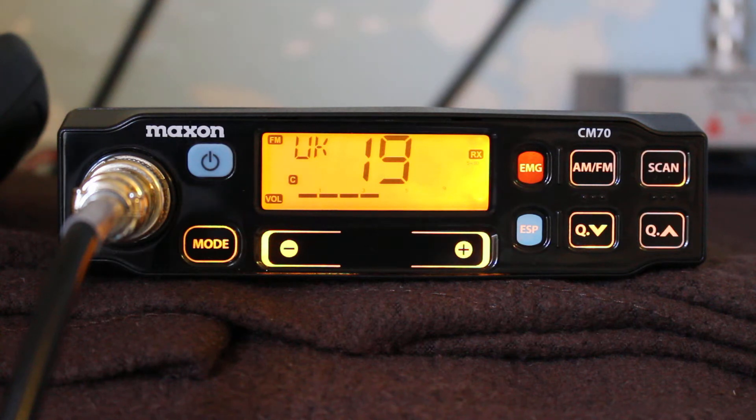When I turned it on and went through the country setup, it actually already had the PO and RU bands there. They go from 25 to about 30.5 megahertz, and that's what you're enabling by removing the two links, but they were already functioning. What I discovered was they wouldn't transmit, so when I opened it up it turned out that OPT6 was not bridged but OPT3 was, so when I took that out the radio transmitted right across.